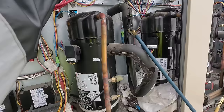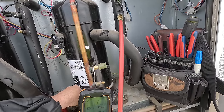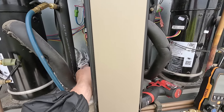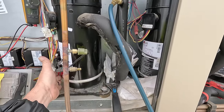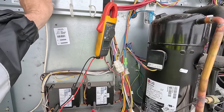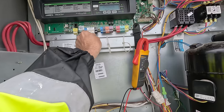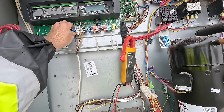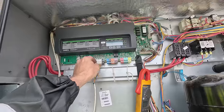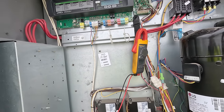That is warm. Doing the hand touch method to kind of see where we're at on some of this. Crankcase heater. They both feel like they're working. So let's go in here to this. Plug it in, see what we get. Instantly jumps up to occupied. Controller just blanked out. So we got a short something going on here.